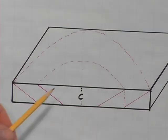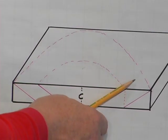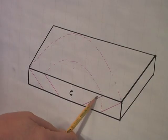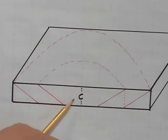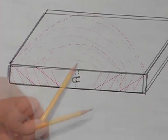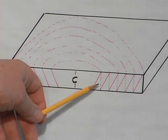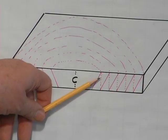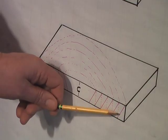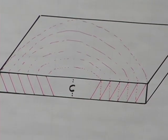In my second sketch, I've drawn my angles much flatter. By doing so, I've been forced to reduce the number of rings, but I'll have more wall thickness to play with using this layout. The downside is I'll only be able to create a vessel 2 layers tall. As you can see in this third layout, I've placed my angles much closer together, and in order for the diameters to match, I've had to make the angles much steeper. Now this layout will give me a lot more rings and thus a much taller vessel, but I'll also have to deal with a much thinner wall.